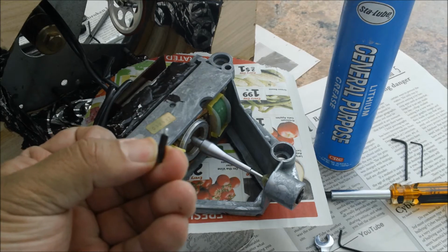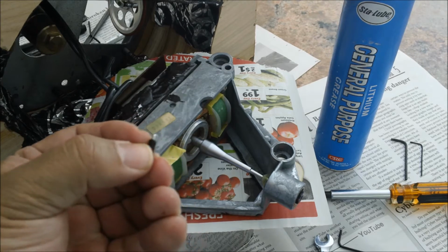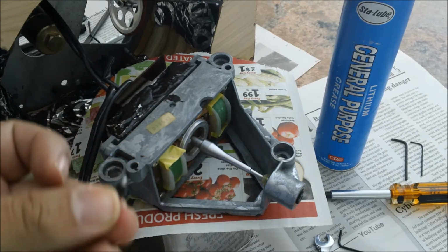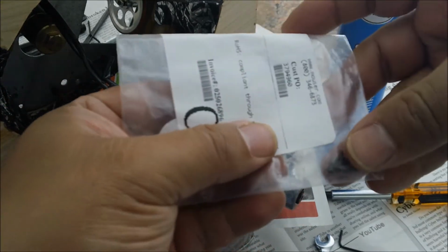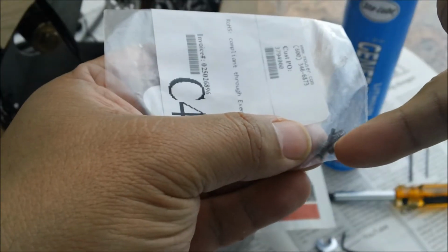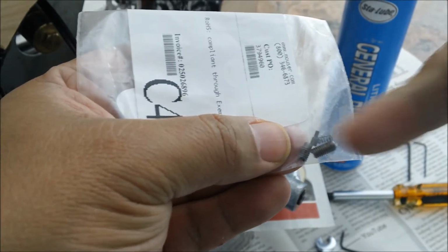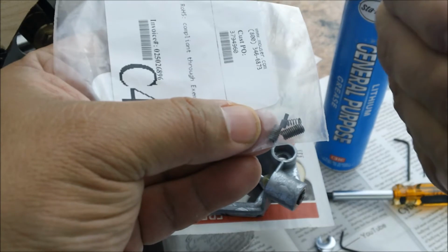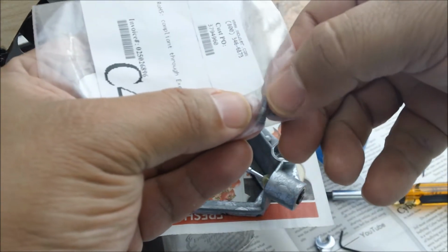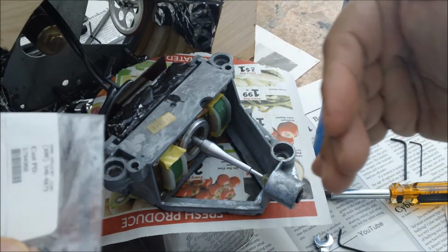a Jergens plunger, but I wasn't really satisfied with it. The motor was louder than I wanted it to be, and I think the reason why is because the original, we can see right here, has, of course, the screw, which you can see here broken too. It has a spring, and then it has a flat movable or free piece, I don't know what you want to call it. I guess you could call it a little plunger, there that actually holds the spindle.